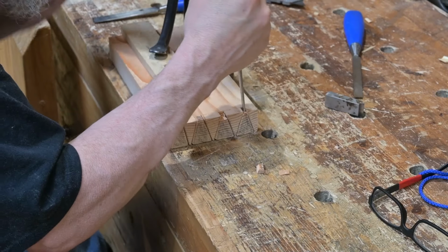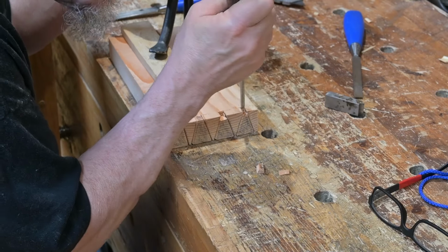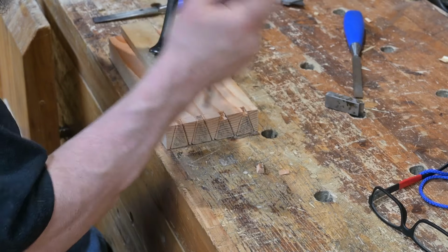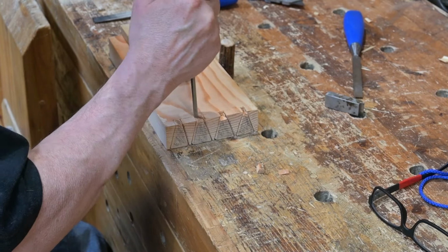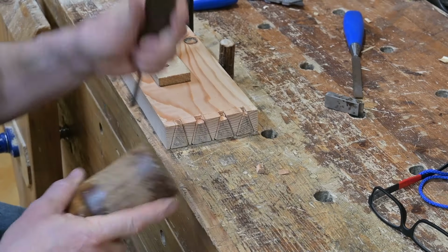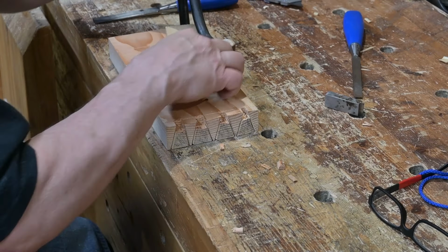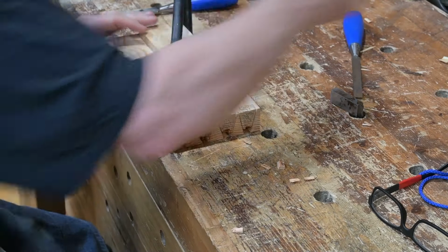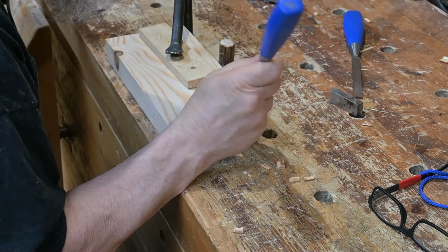And he likes to do the vertical cuts and then cut into that vertical cut, gradually removing material. And just like on the other thinner piece, don't try to do these cuts from one direction all at once. Work first from the smaller side that's getting cut out, and then to the larger side.